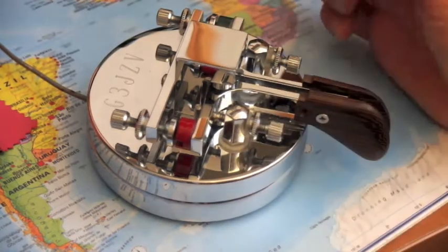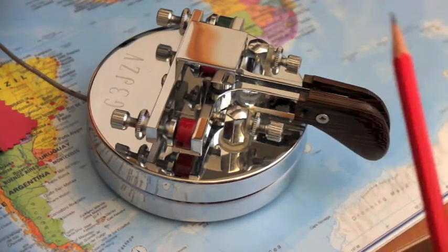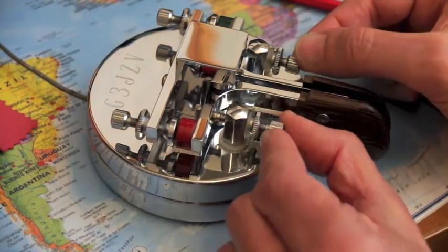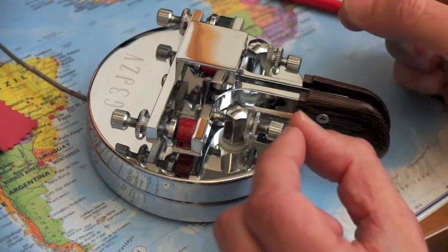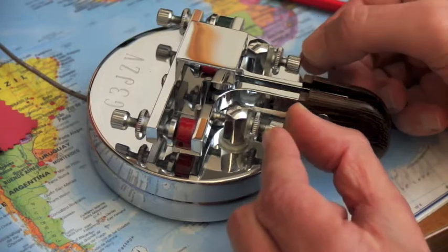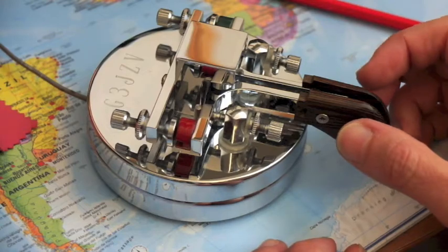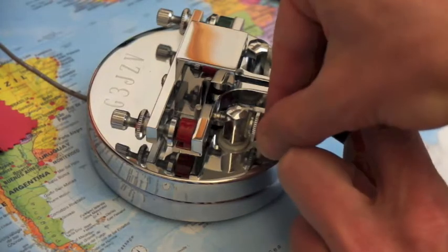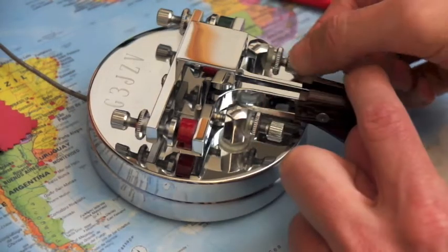If I change the distance among the contacts and the lever, this key can be turned into a single lever key. It is quite easy — you first pull toward until you close both contacts and have the iambic series dot-dash dot-dash. Then you turn slowly both levers and press both contacts together, and turn back a little bit until you hear only dots and only dashes.